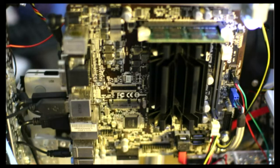The whole robot needs computer vision processing power. A Kinect can usually saturate a USB 2 bus, so if you have a BeagleBone Black or Raspberry Pi trying to do computer vision, you may not get good results because you'll spend all your time just servicing the Kinect. In this case I'm running a quad-core Atom, which may be upgraded to something more powerful in the future, with an external laptop battery as the aluminium thing that sits behind it.